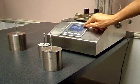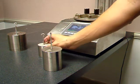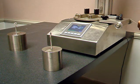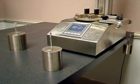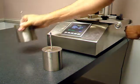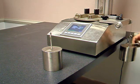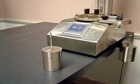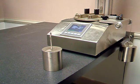When that's done the unit is calibrated, and you can test the linearity in the torque readout screen by hanging different weights on the pulley. Always make sure when you hang the weight that the wire is running inside the groove on the pulley. You can hang the 10 lb weight and check the readout on the screen, or a combination of different weights. Just make sure the weights are not vibrating or excessively moving, otherwise the readout may be inaccurate.